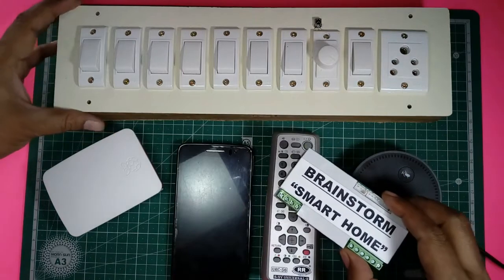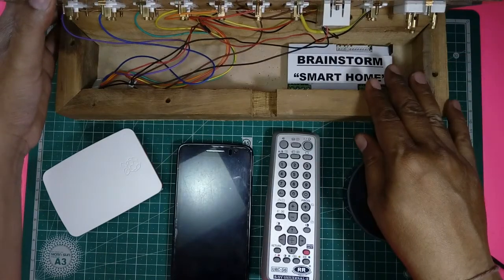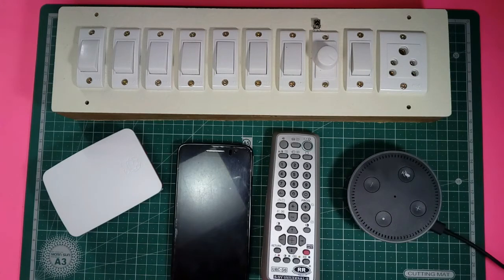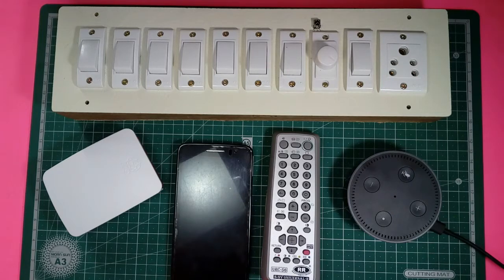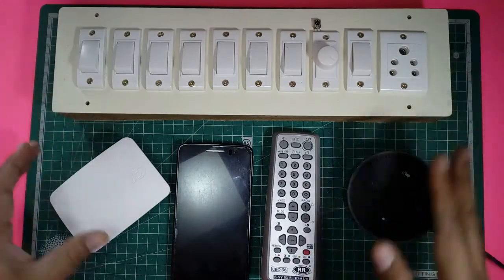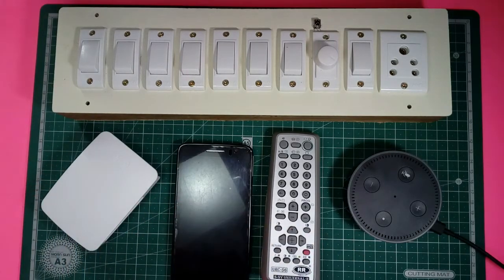This board is very small and compact, so I'll directly be able to install it in this outlet — it fits in this type of old outlet, so no further modification is required in the house. This is a Wi-Fi device, so it connects directly to the router through Wi-Fi and no additional wiring is required. I'm using a Raspberry Pi as an openHABian server, so my mobile and Alexa app will be able to control the outlet using openHABian.